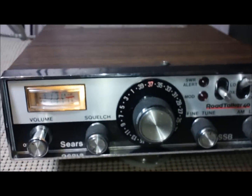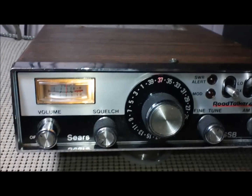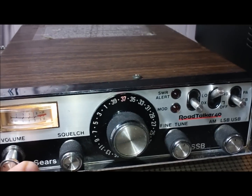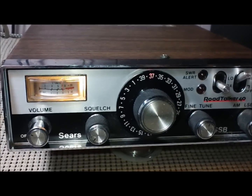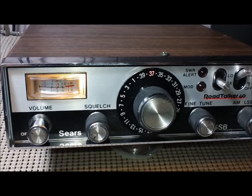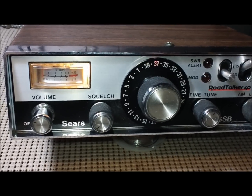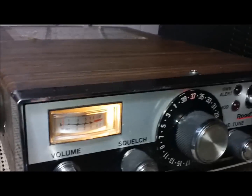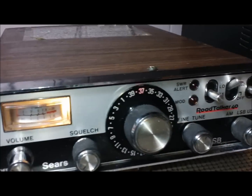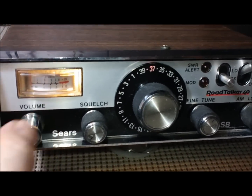QSL, yes, that's okay. Yes, but some, like the TRC 451, the 432 maybe, and there's some others, they use, like on Astatic mics, the yellow receive ground wire. So if you've got a mic that has that receive ground wire on pin 2 and you plug it into these, you will short the radio out and hopefully just blow the protection diode only.